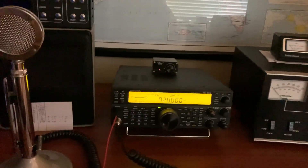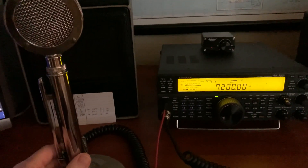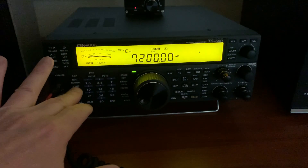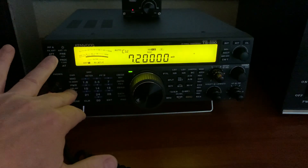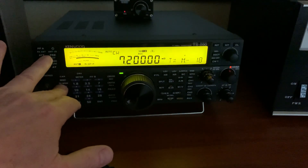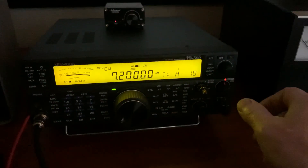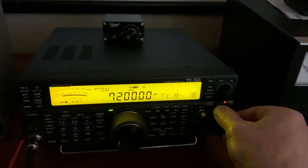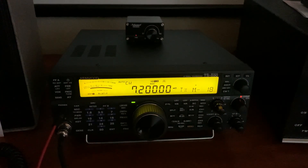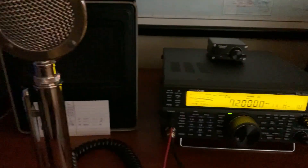One thing I noticed: I was using my D104 with the FET buffer, and I put this thing in audio monitor mode. On this 590SG radio — even the older ones — you have a TX monitor mode. You just put your headphones in, this is the audio control for it, and you can hear yourself. I started talking and was getting all this buzzing on voice peaks really bad. I thought, well, I guess I'm getting RF in the mic.